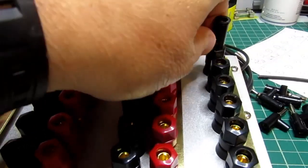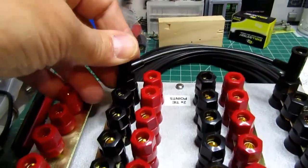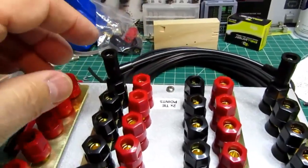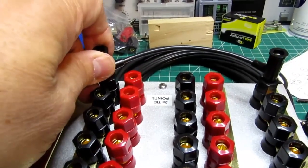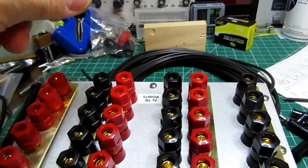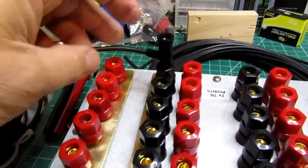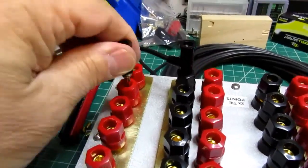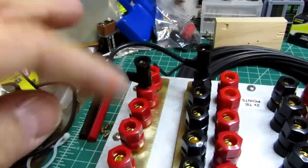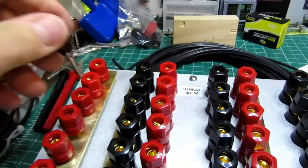It can bridge across like that, but it shouldn't need to go any further than that. This also allows me to put all the resistors in series if I want. Certainly I can do things like this and then just do a bunch of diagonals to make them in series, and then bridging one series to another.